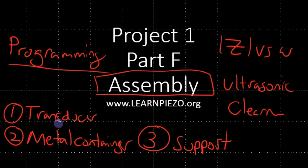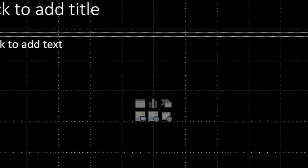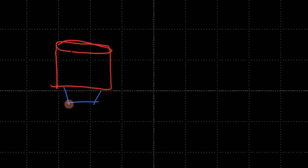You don't want your transducer laying on the floor. I'll basically show you the general setup. Let me describe what the ultrasonic cleaner looks like. We have a metal container here — like a bowl, pan, or pot. This is what we're going to be making: some type of metal cup or metal pot. Then we have our ultrasonic transducer below it. We have two piezos in the middle, a back end mass, a little screw, and an electrode coming out.